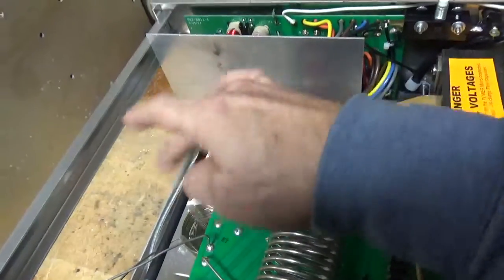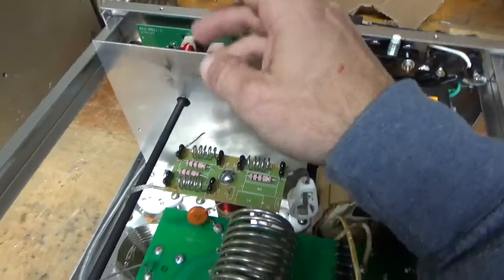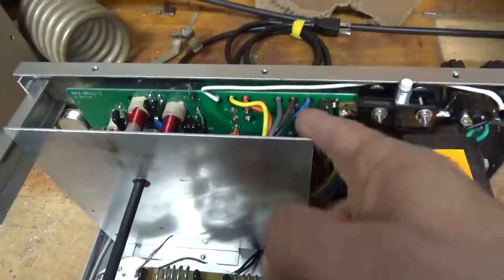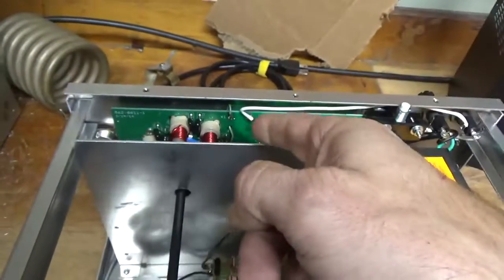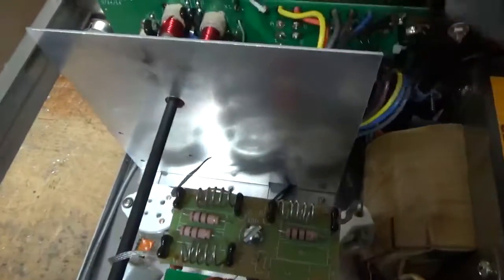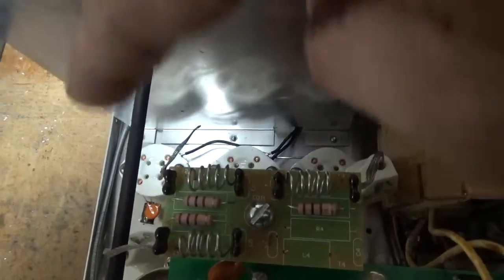I will put more heat shrink across it and instruct the customer to keep the strap away from it when he connects them to the top of the new tubes that he'll be getting from Pentelab. I'm going to remove the metal oxide varistor from the board, and remove the gas discharge tube from the board — both on the filament side. I'm going to put new gas discharge tubes at the base of the sockets, one per side of the filament. All three filaments are in parallel, so I'll only need two down there.